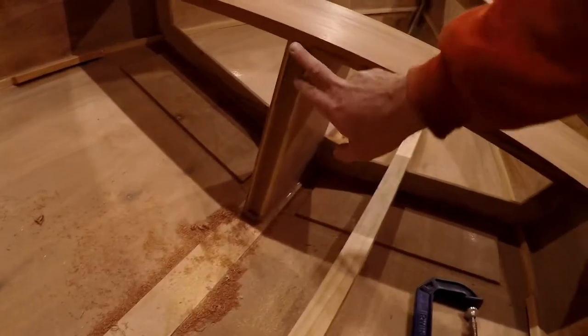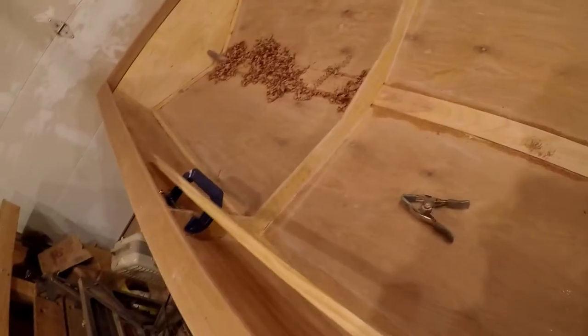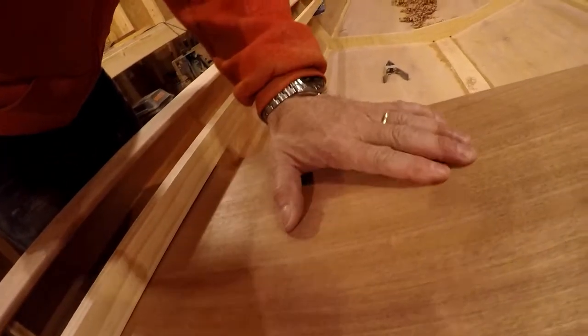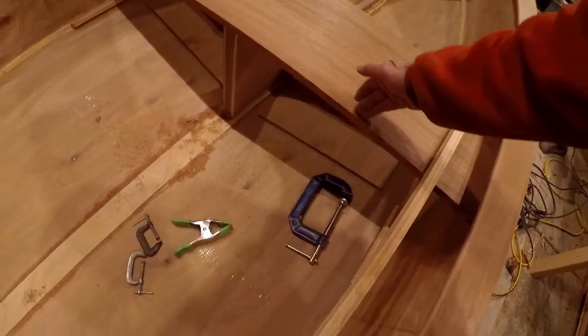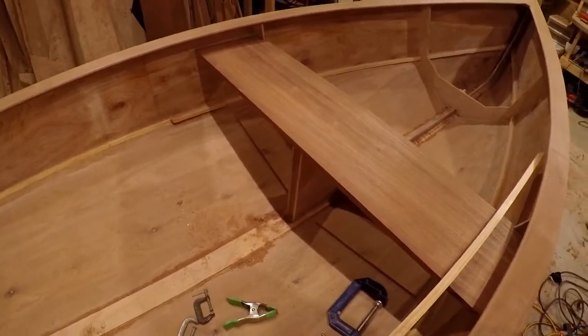Got the board let in — we'll be filling in with a face piece of mahogany there, and a similar one back here. Let's see how this looks — pretty good. So we're really looking for this line, maybe that was what was missing, to continue on about where we want it. We've got to decide how far out this comes, what the joint's going to look like, where we install this, run the round-over where we can. That's pretty fun — that's a big step.